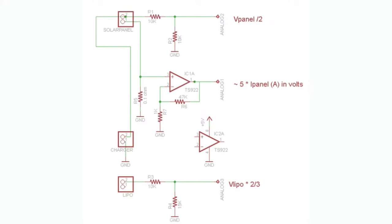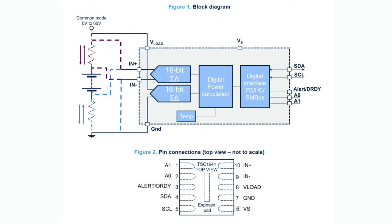That gives you low-side monitoring and voltage monitoring, and you can calculate the power — which is great — except for a few things. One: a lot of components, and you can only do low-side easily. High-side is harder; you need an op-amp that can handle that voltage, otherwise it gets very complicated with the common-mode voltage. Second: you need two analog inputs, maybe you don't want that. Third: it's not as easy to set up interrupts or have low power, because the op-amp and divider are constantly on.